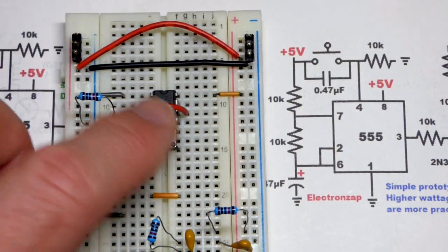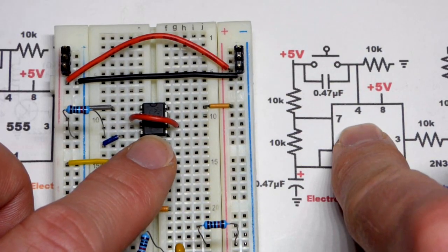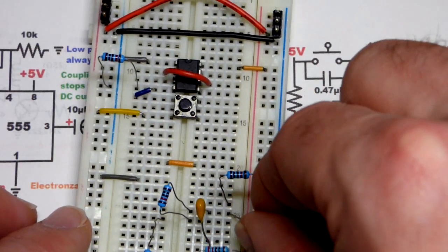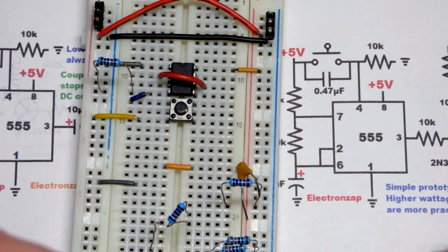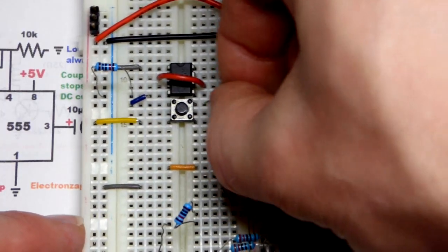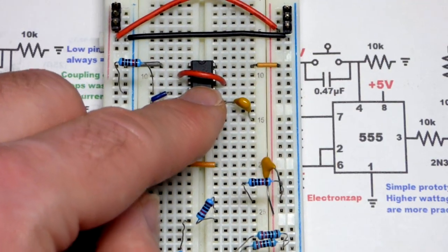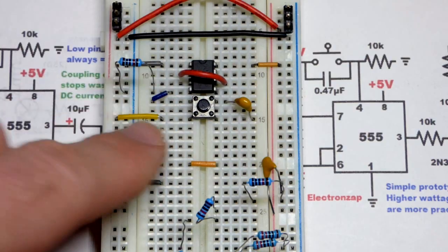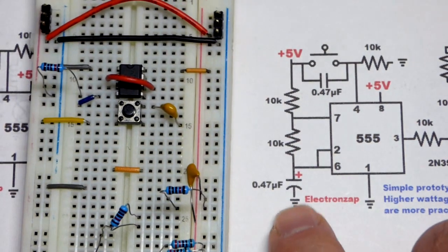When you close the switch you give a high voltage and it lets the 555 timer do whatever it is wired to do. I also have a capacitor there for switch bounce - when you close the switch it bounces up and down, and this will charge and keep the voltage to the reset pin high enough to not reset it, even with brief breaks in the switch. With the 10k resistor, when you remove your finger it will discharge pretty quick.